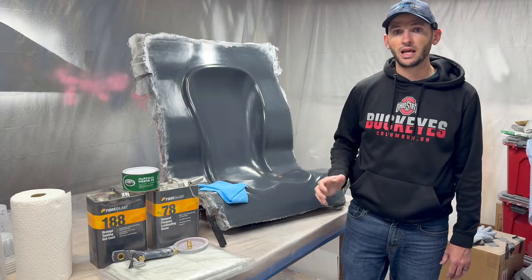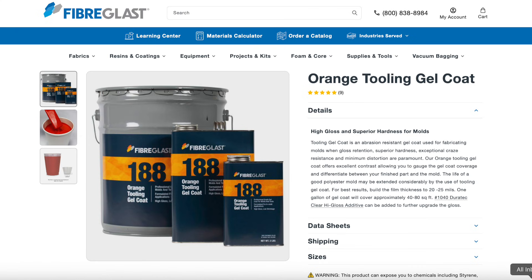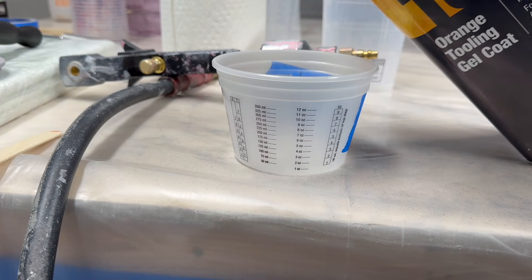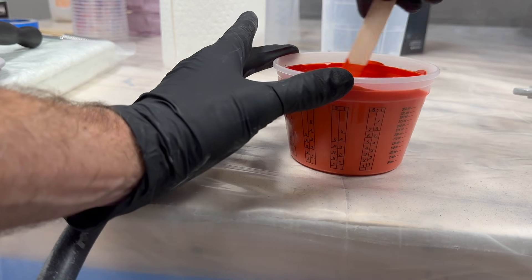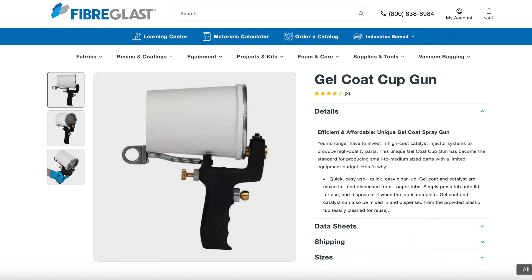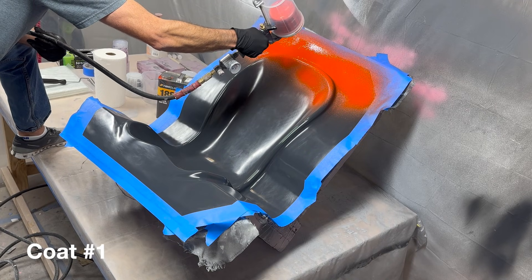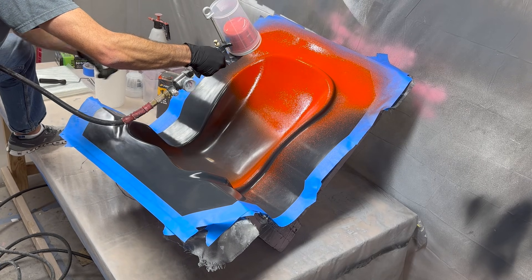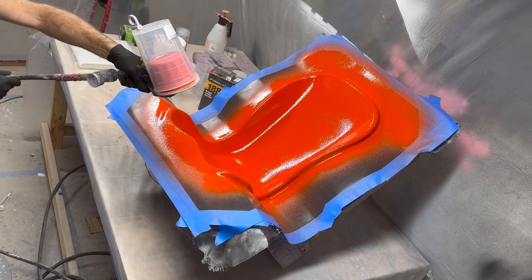The next step is to lay down a layer of gel coat. For this we're using Fiberglass Number 188 — it's an orange tooling gel coat. This is a very strong surface meant for multiple mold releases and it's different from the typical gel coat you'd see on boats — it's specifically designed for tooling. The gel coat is a polyester gel coat and we're going to be kicking it off with 2% catalyst MEKP. We're going to use a dump gun to apply this gel coat in about three coats. You'll lay down your first coat medium-thin — you don't want to put down too much or it'll cause alligatoring. Let that flash off for about 20 to 25 minutes. You want to get to the point where you can put your gloved finger onto the surface of that curing gel coat — you want it to be sticky but no material should transfer onto your glove.